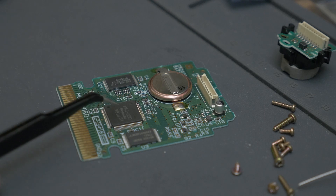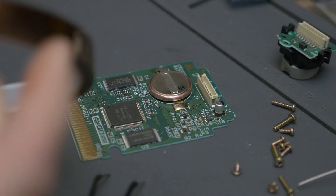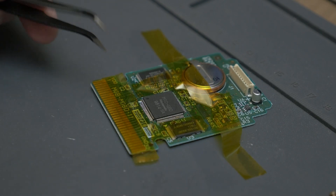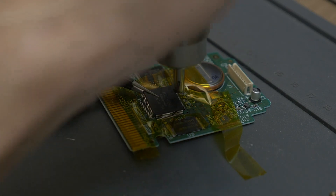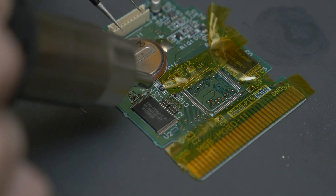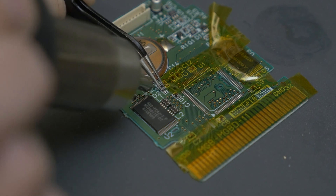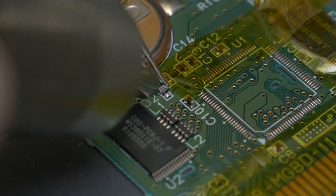The way I'm going to remove this chip is with hot air. There are a lot of other small components all around, so I'd recommend using some Kapton tape to protect them. I'm switching to tweezers to grab it — not applying any twisting motion, I want it to break away very naturally. Keep gently testing to see if it's come free. And there we go — the chip is desoldered. Be careful not to heat up the battery too much.